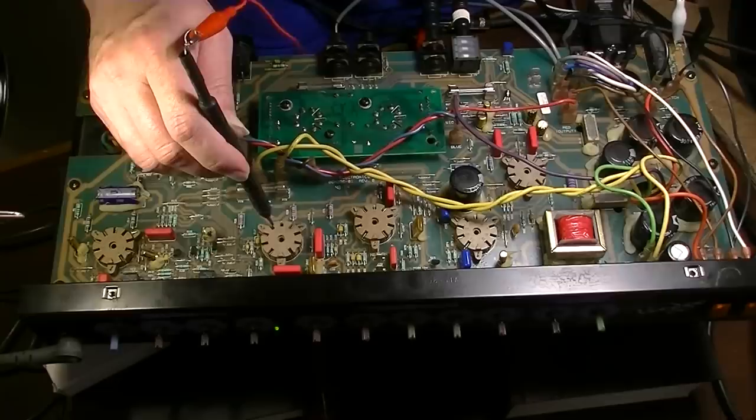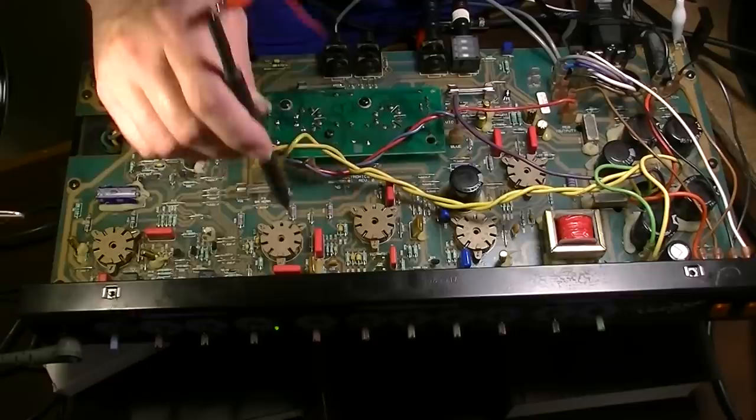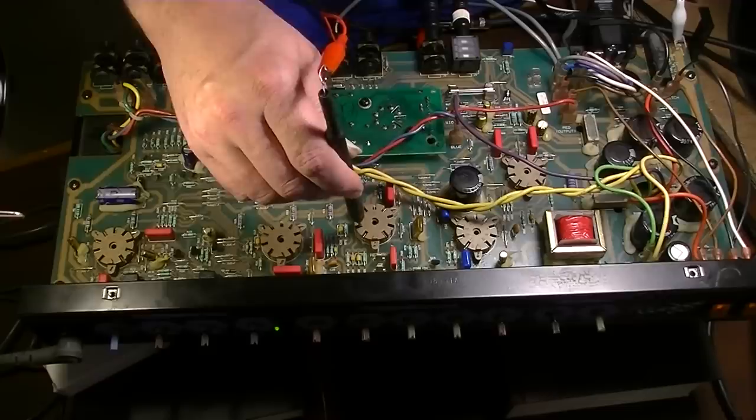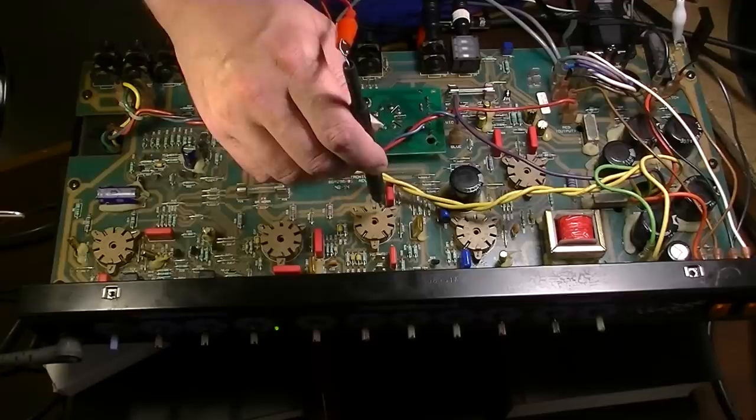Now let's skip over here to the second half of it. I've got signal coming in. Way amplified signal coming out. So somebody's home there. I've got nothing coming in here. So this is doing something else. This might be part of the reverb. Not really sure on that. But we'll keep that under our hats that somebody's not home right there possibly. So we've got a lot of signal being amplified right there. We got signal going in and coming out. So somebody's home there on the second half.